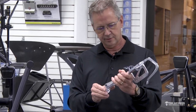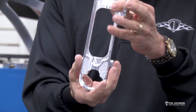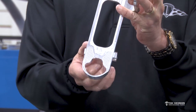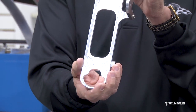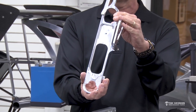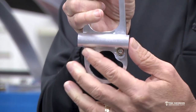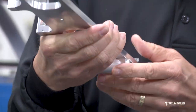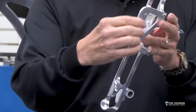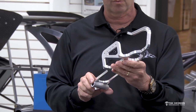The cable pedal was a bit of a feat to do, but we wanted to make it adjustable. Like with a 4130 kit, the tube that pivots on is not welded solid to the pedal — it's made to be adjustable so that sitting in the car, you can tilt the pedal slightly. A pedal straight up and down is not that comfortable; it needs to lay over just slightly. So we made this mount adjustable — you can pivot the pedal how you want it, lock it down, and it will stay right there. It incorporates a heel pad and your cable hooks up here, with a selection of holes to adjust the cable throw.